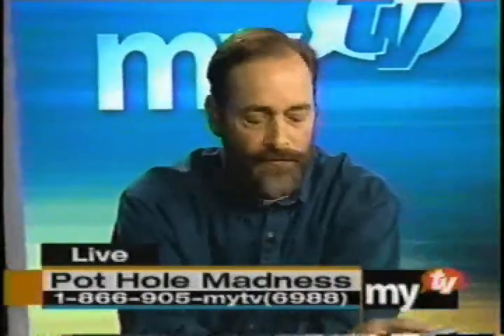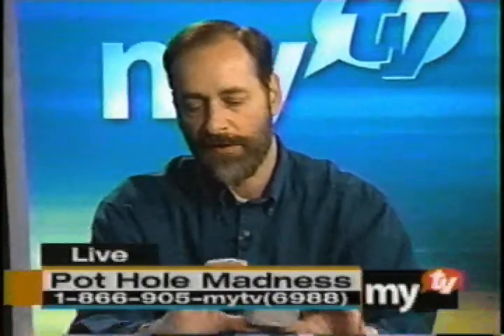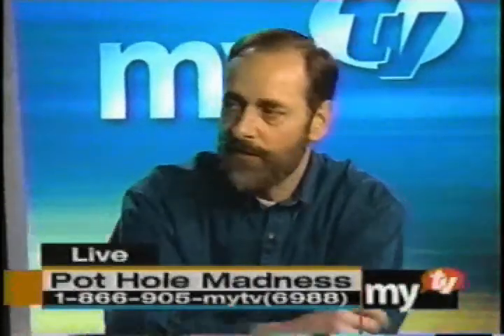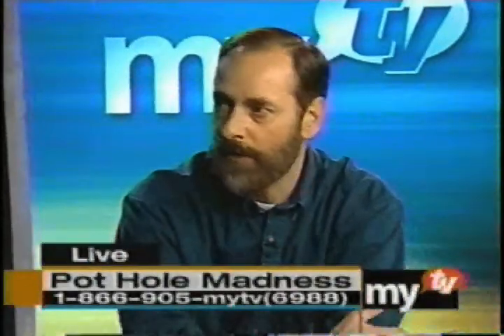When the temperature outside is at or near freezing — it's the same thing with Dirt Glue without the catalyst. If we mix Dirt Glue into soil at a depth of about 2.5 inches, it's going to take days or weeks to cure all the way to the bottom. That doesn't mean you can't drive on it — it's solid enough — but it's not completely hard. If the temperature goes down, the time for full cure to complete depth is going to go up exponentially. But with the catalyst, we've eliminated that slow curing time.